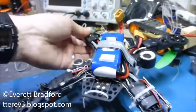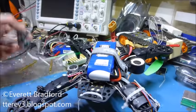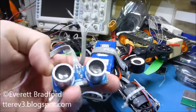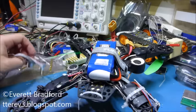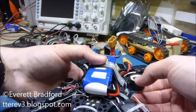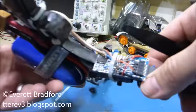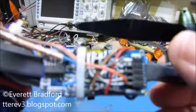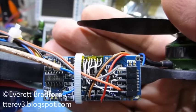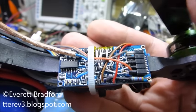I discovered that the HC-SR04 sonar is way too easy to trigger — it would get false triggers all the time, not from pings but just from acoustic noise from the props and sometimes electrical noise. So I had to strip the microcontroller off the board and replace it with my own, and that allowed me to analyze the echo signals directly.